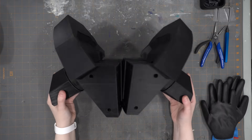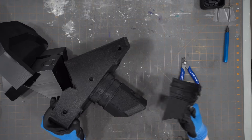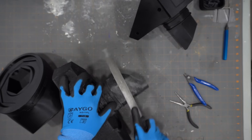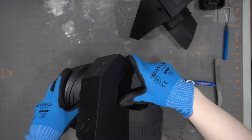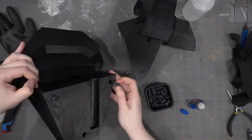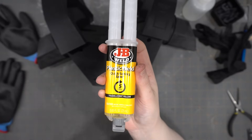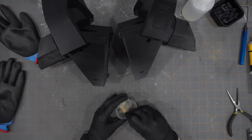Back to the main hip pieces, I realized I was going to have to sort of break my tradition and put these pieces together if I wanted to be able to actually test build this droid. I started off with removing the support material, which removed so easily. I did sand the poles that go into the thigh pieces just so that they more easily slid in and out. Next I super glued in the dowels onto one side, and then pulled out my plastic weld — this stuff actually comes in different set times. I typically use the five-minute one. The different colors are actually different reaction times for the epoxy itself.